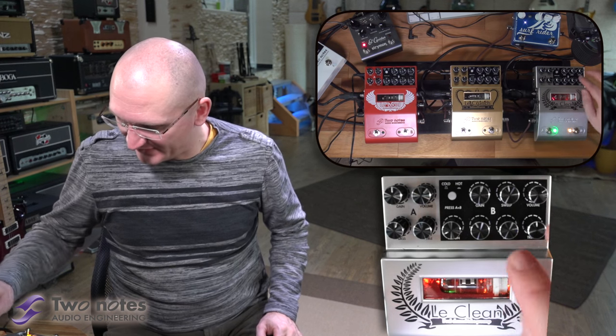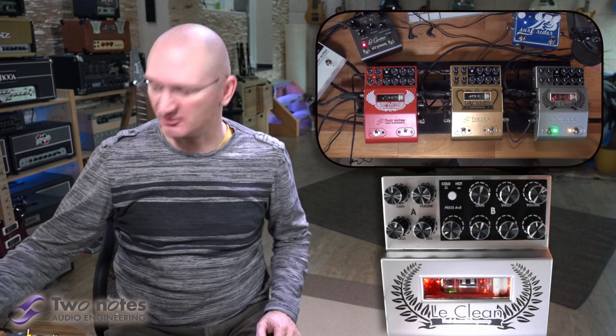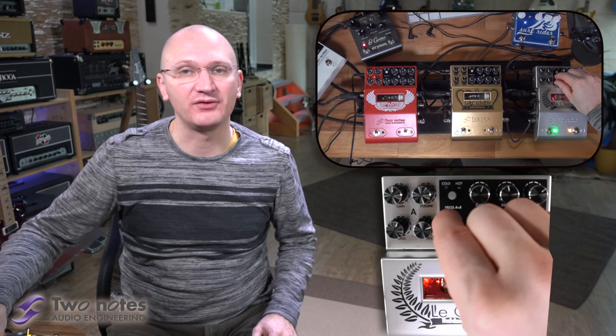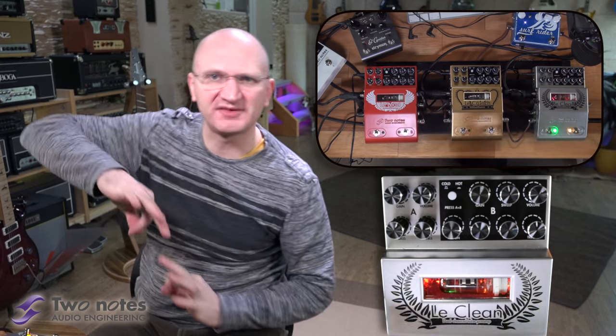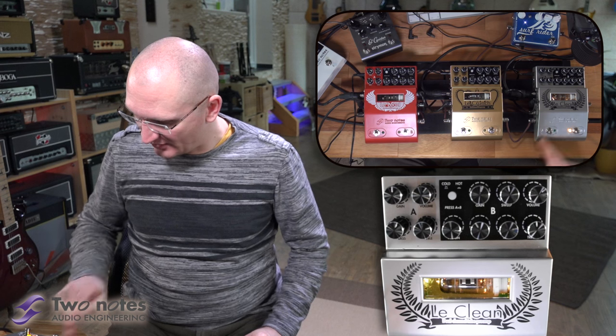Where was I? So if you're in hot fusion mode, obviously channel A pushes channel B. That means both gain knobs and both volumes will have something to say, as well as how high the fusion knob is. So you increase fusion, you might have to take volumes down. So it's a balancing act that you have to go through.